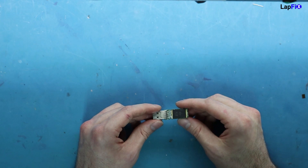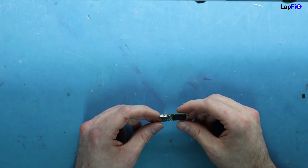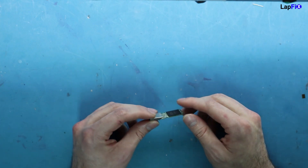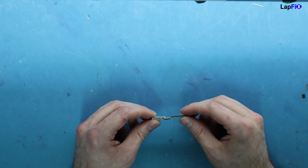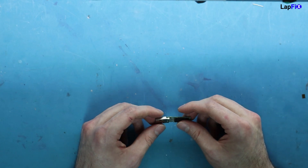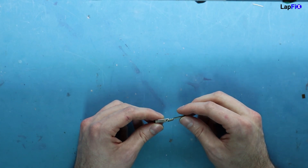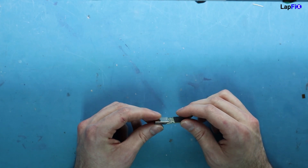Let's go take a look under the microscope to make sure nothing is damaged and to see what the possible issue is — whether it's something we need to solder or repair. You don't want to just bend it back because you could make this worse. If you bend it, you can also rip off the traces — those four little lines. If one of those rips off, it would make data recovery a lot more difficult.